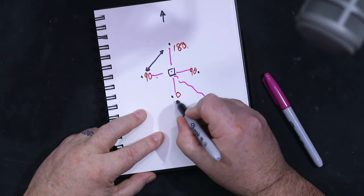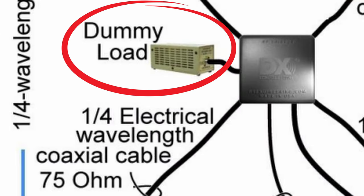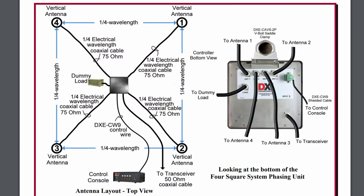It's not just about delays — a lot of this is about matching. The hybrid coupler and phase inverter handle the directivity and the type of beam you get, while the LC circuits help with the match. They also have a dummy load attached: you get some stored energy in there and it has to go somewhere, so you dump it to the dummy load. If you look at DX Engineering's four-square box, you'll see connections for all four antennas, the TX input, and a dummy load connection.